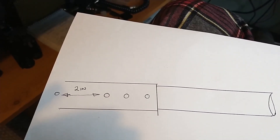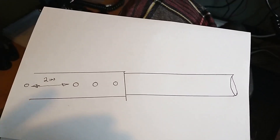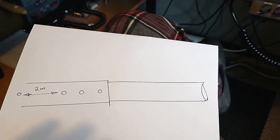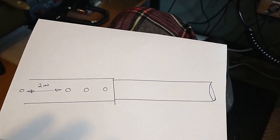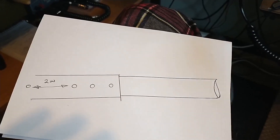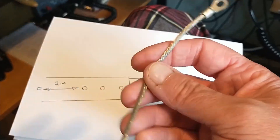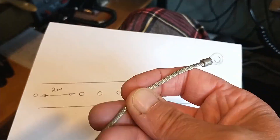So at 7.2 we're just over 1.6. I'm happy enough with that, I'm going to leave it at that. It hasn't affected any other bands of the antenna. Plus I noticed when connecting up the balun that the wires they give you to connect the elements to the balun are terrible - very flimsy, with little eyelets crimped onto them. I've used proper earth wires instead and I'd recommend doing that - good sturdy ones, something a bit more substantial than what comes with the antenna.